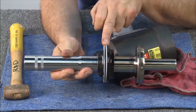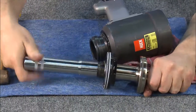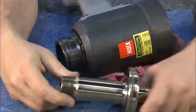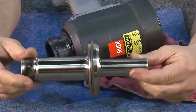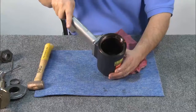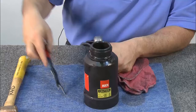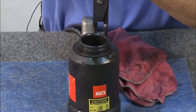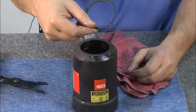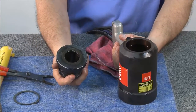Both the front gland and piston have been removed all in one process. To disassemble, remove the bullet, the spacer, the front gland, and you're left with the piston. The 3585 PT has the advantage of being able to remove the adapter in case a collet gets stuck on the piston. To remove the adapter, set the tool upright and insert a pair of TruArc pliers into the TruArc ring. Squeeze and lift the ring off the adapter. Lift the cylinder and you'll see that the adapter has been removed. Now the tool is fully disassembled.